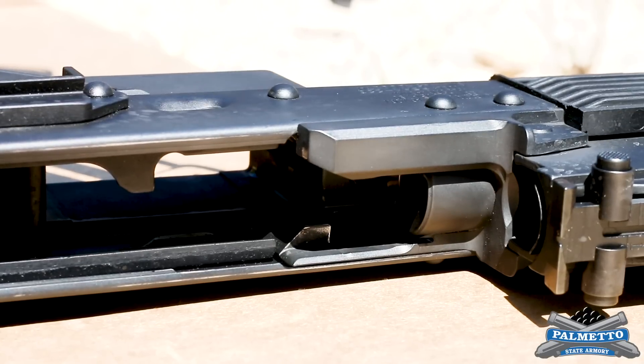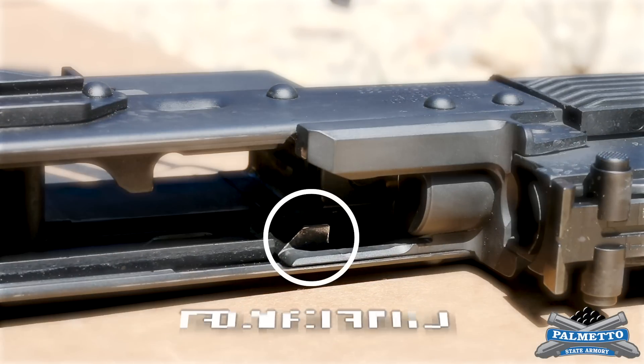You can see a little bit of polish showing up there. That is totally normal — that's where your bolt is rolling over the trunnion as the round is loaded into the chamber, and then coming back up and over that as the round is ejected.